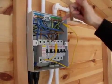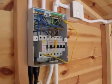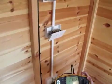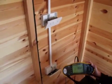That's created a link between the two. We then go to the opposite end of the circuit, which is the bottom socket outlet, and using our multi-tester — a Fluke 1653 unit — set onto continuity. I've already zeroed out the test leads.